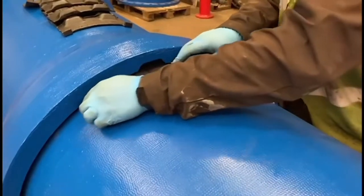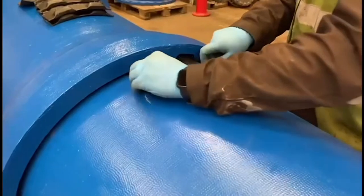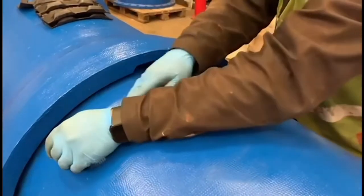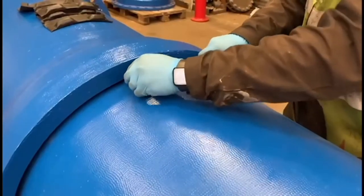When the joint is under incurred thrust loading, during site pressure testing and subsequently when in service, it is these plates that lock against the weld bead and prevent joint separation from taking place.